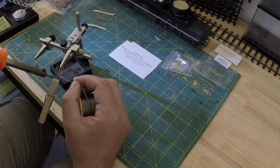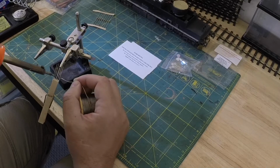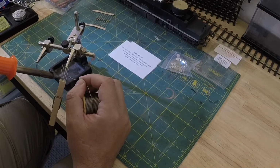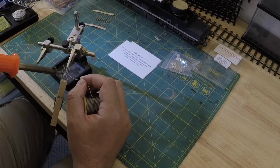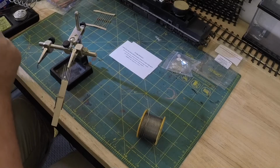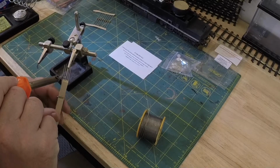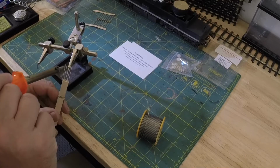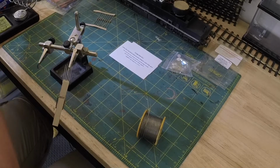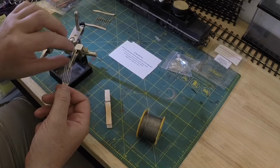So literally a little bit of solder on the tip and flash it on. And that's it. I'll join two legs together and the ones next to it as well, but we'll just remove that with the solder. Too much, there we go. So job is done. As quick as that, soldering iron not on for too long because we don't want to cook the LEDs.